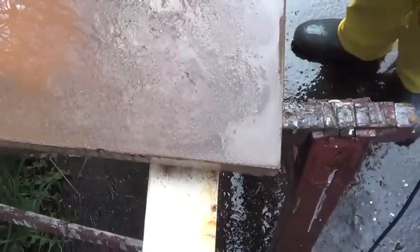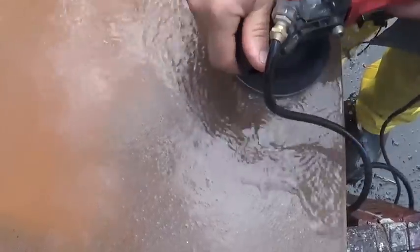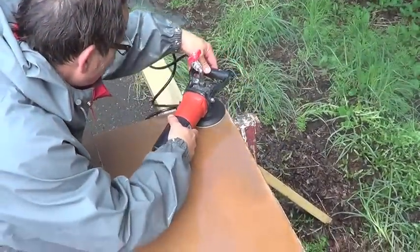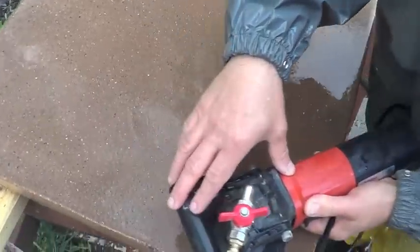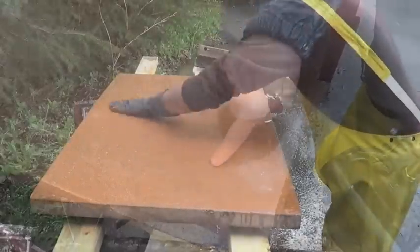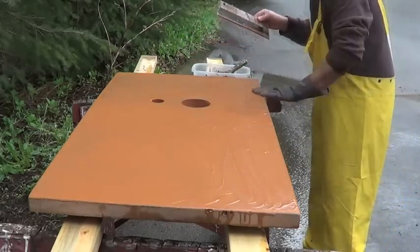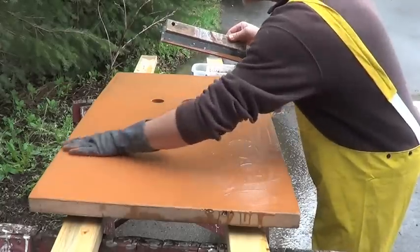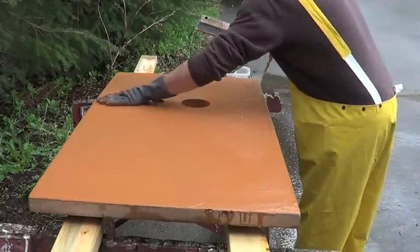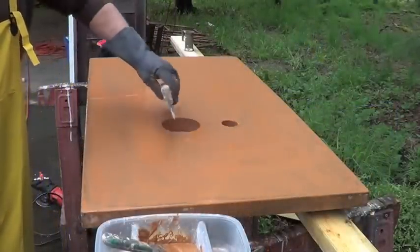Right now what we'll do is take out that top slurry. The concrete countertop is being polished and filled with a colored slurry. We're filling in all the tiny little pores. This will cure and then get polished again with a high grade polishing compound and disc, because it's already kind of smoothed out and you don't want to change the aspect of it.